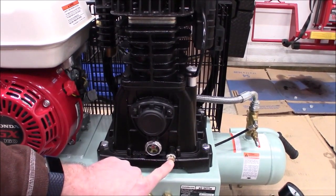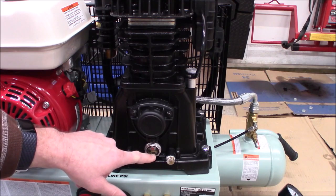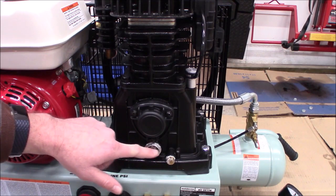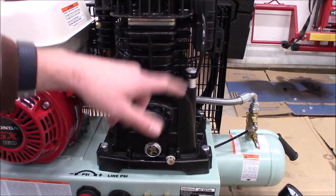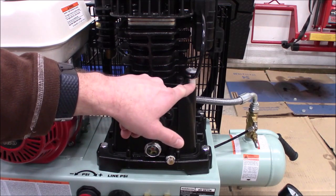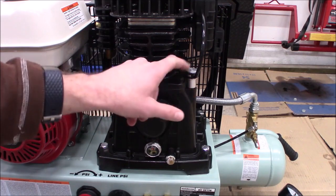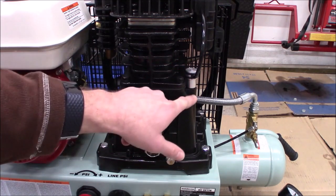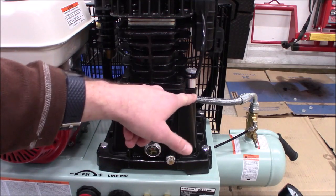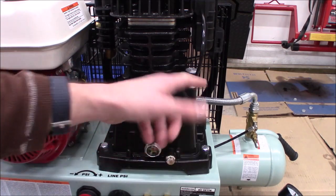Here is your oil drain and here's your sight glass — remember, anything on the sight glass is sufficient and don't fill above the red dot. If you get overfull, you're really going to have issues with blowout in operation. This vent on this model pops out and that's your fill hole for the oil. Make sure you get that seated back in. This one actually has a double O-ring — the first one will snap in, but you need to get it all the way in or you can have some oil seepage out during operation.